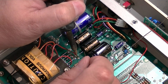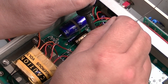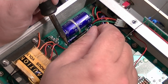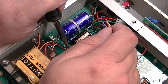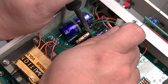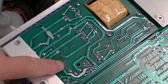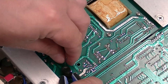It's perfectly fine to solder from the top of your board, and in this case with the big components it helps make sure they're fully flush against the board — if I turned it over I'd have to reach around and hold everything flush while soldering. On the underside, we did get good solder flow all the way through the board from soldering on the top, and now I can trim the leads.